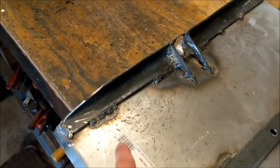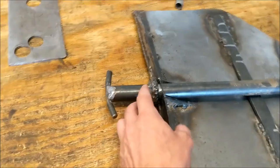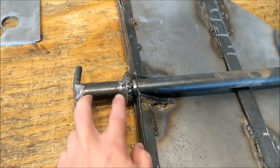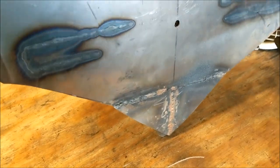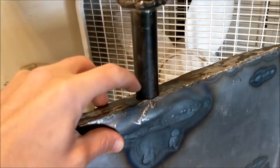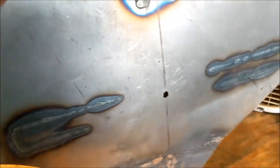I welded all of this up, and then I have this collar. That way I can drive the stake and this mud plate together into the ground and still leave a substantial gap to hook my hook onto. This will hook in the ground, and then as you're hammering down, this will hammer down and catch the plate, hammering down some more until you're capturing a lot of mud to get yourself some good pull.